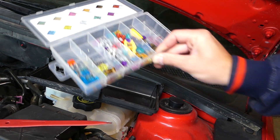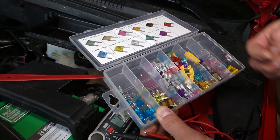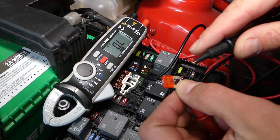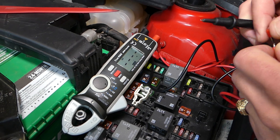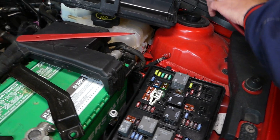You can find those listed in the description as well. Let me grab the replacement fuse and test it now to show you what it's supposed to look like if it's a good fuse. We're supposed to get zeros — and there it is. So this was definitely a bad fuse.